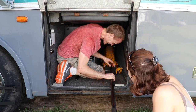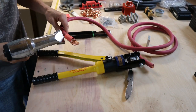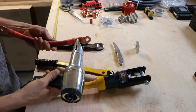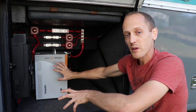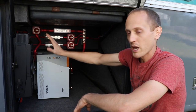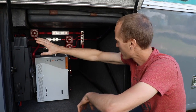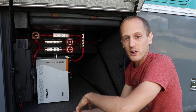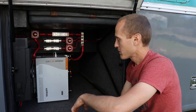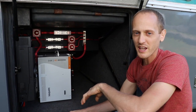Got them all wired up and made a mount to actually mount the inverter off of the same frame, which keeps that 70 pounds off the floor. Then paneled it out a little bit with some matte black plywood, mounted our charge controllers, mounted all the wiring to get the system together. Then it was off to the races with running wires down from the roof and connecting solar panels in, making everything as neat and tidy as possible — it makes it a lot easier to troubleshoot if you don't have a spaghetti explosion of wires hanging out down in your bay.